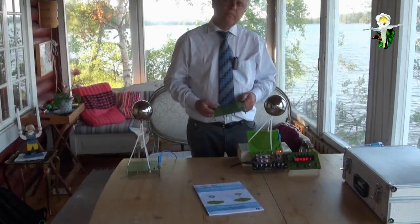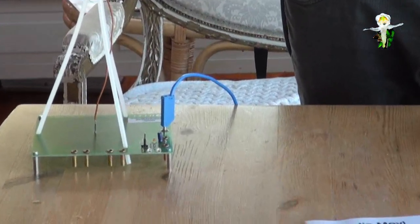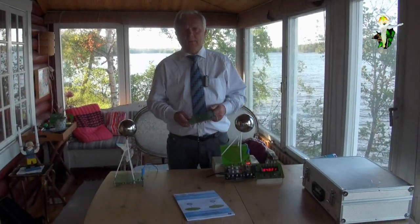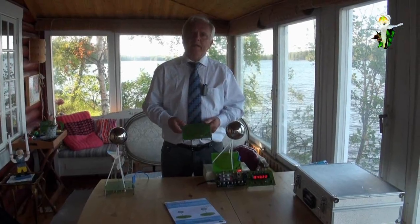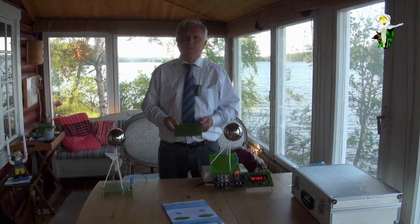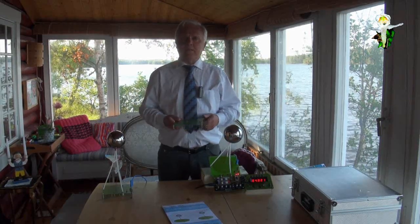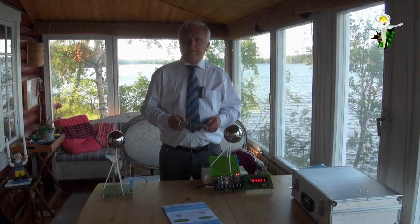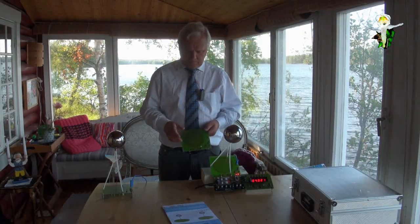Short question. On the receiver part, the coil is identical to the coil from the transmitter? Yeah, it's identical, but inside the experimental kit we have different coils with twice the length of the cable and half of it, so that we are able to combine one coil which is using half of the wavelength and the other one a quarter of a wavelength. This is what Tesla did. Where are those coils situated? Can you point to them?